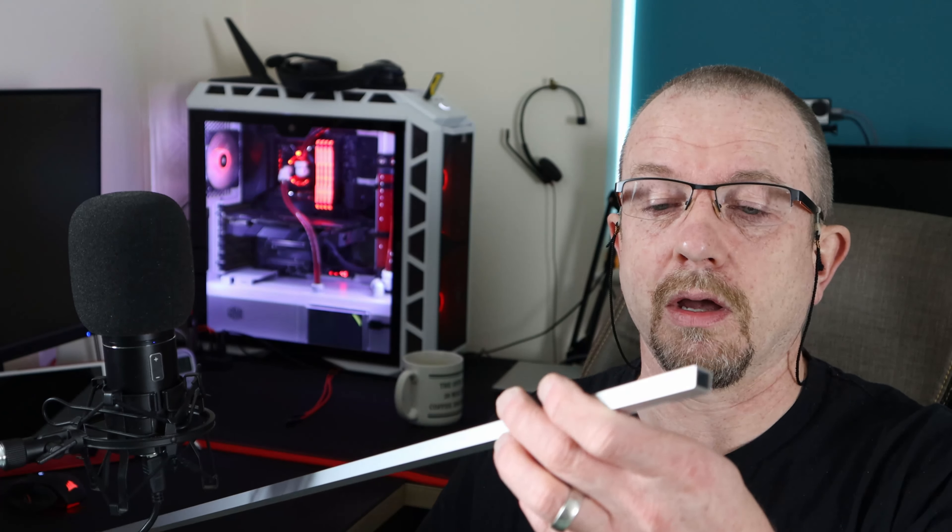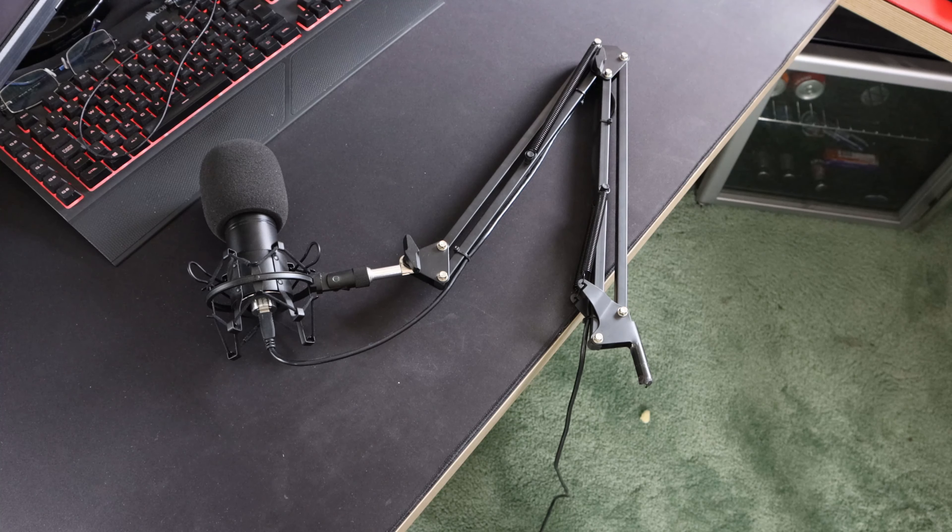This is the microphone I use when recording on my screen using OBS. Currently I have the desk mount on the left-hand side of my desk and try to bring it as close to my mouth as possible. The distance from the clamp to the microphone is 33 inches or 85 centimeters, and the individual arm sizes are around 13 inches or 33 centimeters. I've bought some aluminium — 10mm by 10mm, a meter long — and I'm going to cut it in half, replacing the 33 centimeter arms with 50 centimeter arms. That should give me a total length of just over a meter from the clamp to the microphone, meaning I won't have to shift my chair, desk, and camera over to the left just to get the microphone up to my mouth.